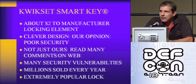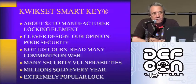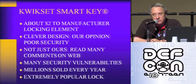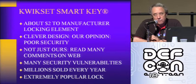This lock is a patented design — it means it's clever, but it doesn't mean it's a secure design. Reprogrammability for the consumer is a very neat idea, and several manufacturers have come out with reprogrammable locks. The problem is there's always a trade-off. A pin tumbler lock is the most secure mechanical type of device, and when you start altering that design and using little tiny sliders, they're not pin tumblers and they're not as physically secure. The proof is how you open them in 30 seconds or less — and frankly, we did it with a screwdriver, a small vice grip, and a piece of a key blank.